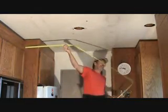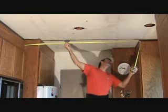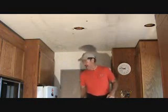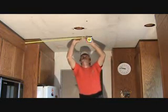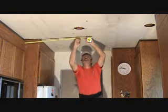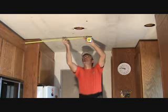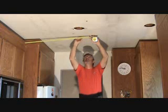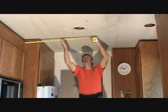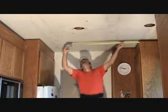I'm going to check this out here. I got 68 and three-quarters, which would be 34 and three-eighths — you just split it, 34 and three-eighths. At this point it's going to be right here. And I can mark on this ceiling — this whole entire ceiling right here has got to be patched, textured, primed, and repainted. The last thing you want to use is a felt tip pen or some sort of pen, because that ink will bleed through sheetrock, mud, primer, and paint. 34 and three-eighths from there, and I'll pull it back this way, 34 and three-eighths.